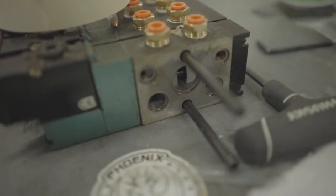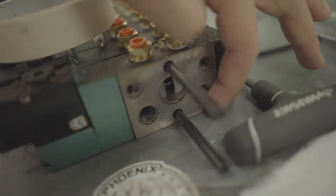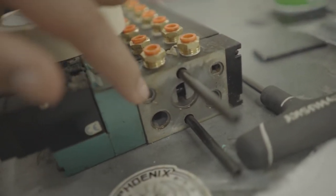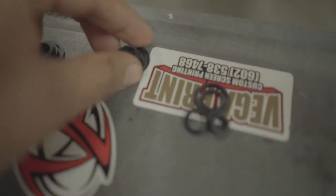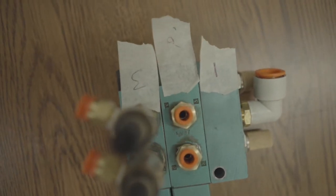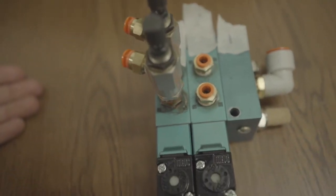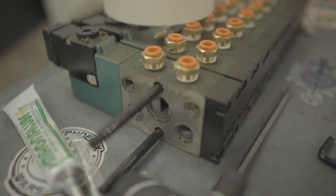On the sides of the MAC valve there are also gaskets — it has five in between each one where they sandwich together. Those o-rings are in pretty good shape, so all I'm going to do is clean them up. They were pretty filthy, so we're getting all the debris out of them. We'll let those rest a bit, and after we're done taking all of these apart we're going to lubricate them. They're labeled and I'm just going to stack them in order as I go, then come back and put all the o-rings where they're supposed to go.